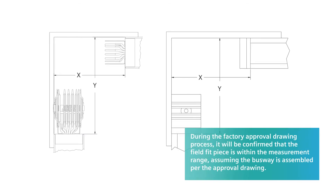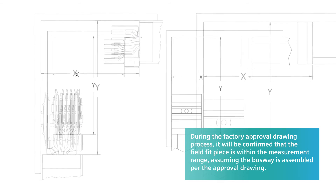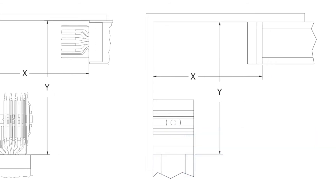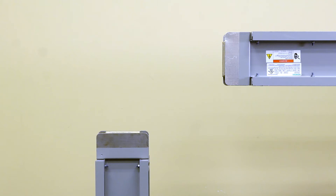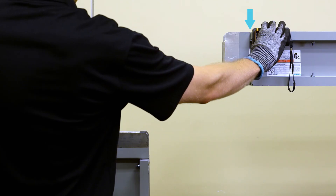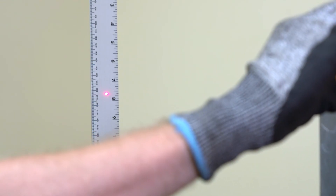Measurement of a flat 90-degree elbow is slightly more difficult. The same reference point, the joint support, is used to measure this fitting. In this case, you will need to make two measurements, both to the outer surface of adjacent bus, determining an X and Y dimension. These will drive the elbow-leg lengths. Elbow minimum and maximum lengths are defined by orientation, amperage, and conductor material.